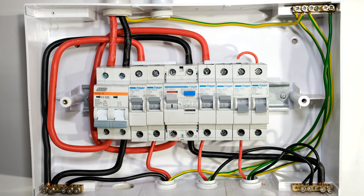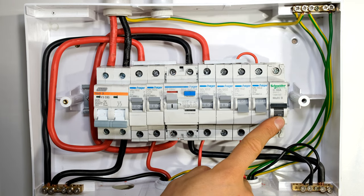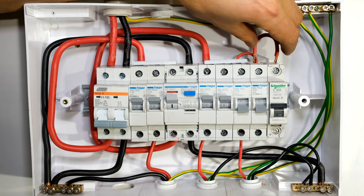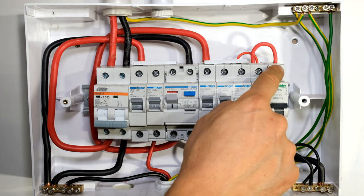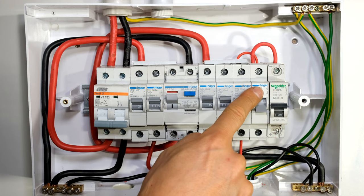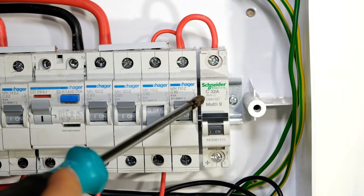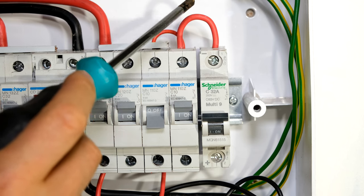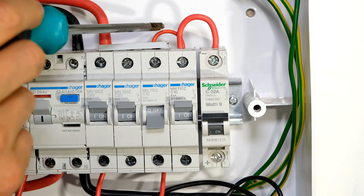For example, I've now added a 32 amp circuit breaker, and right over here is where the hazard takes place. I've now put a bridge between this circuit breaker and that circuit breaker, but I've effectively put them in series. I've connected a 32 amp circuit breaker — and yes, this wire can handle 32 amps — but notice it is now connected in series with that bridge.